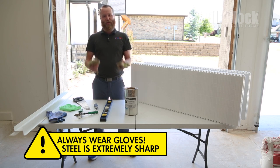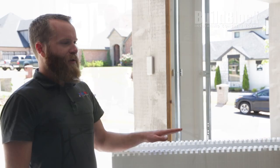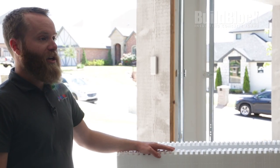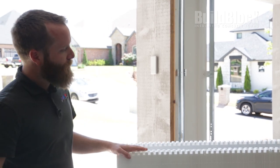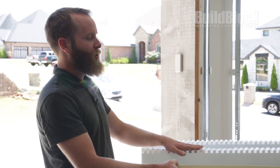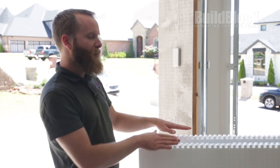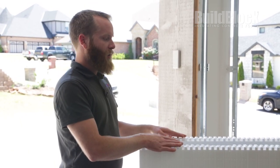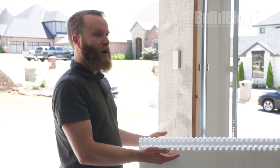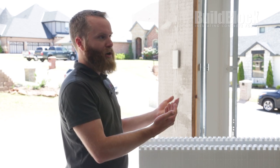We can't reiterate enough — it's extremely important that you wear gloves when working with the steel. It's extremely sharp and will cut you if you don't take the time to protect yourself. The first step is to remove the interconnection from the top of the block. Build Block is 16 inches nominally; however, when you introduce the track you're going to increase the height of your wall by half an inch. It also may be important that you're taking nubs off both sides of the block. If you have a raised foundation or are coming up from a basement, you may want BuildShield on either side of the wall so that you have a continuous barrier on both sides.